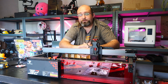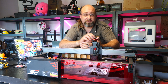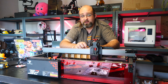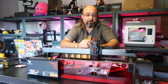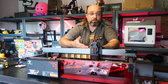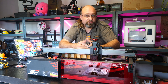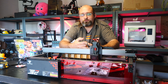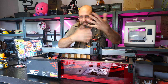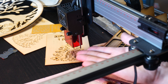Finally, it also features an auto-focusing system. Once you've imported the settings into Lightburn, you'll find a number of custom buttons which let you set the thickness of the material that you want to cut so that it's focused in the middle of the material, or you can set it to engrave where it's focused on the top. You can also raise or lower the Z-axis manually to put in something larger or to manually change the focus if you want.